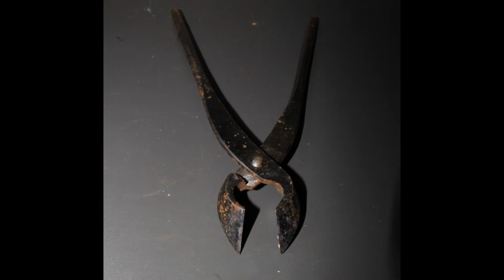Round cutters, or those with a round geometry, such as knob cutters and concave cutters, are a different matter, and you're actually going to have to go to a little more effort to bring these up to scratch. The first thing to do is to use sandpaper, but not just generic sandpaper like you might find at your local hardware store. Rather, you want to get the black sandpaper used for automotive repairs. This is much finer, but also importantly, it's often a wet and dry sandpaper, meaning you can wash it off and clean it out. Something important when we're talking about metal products that'll otherwise fill up and clog the sandpaper.